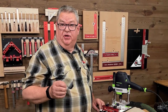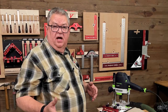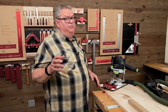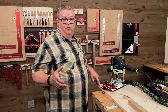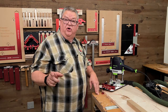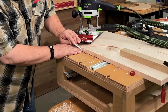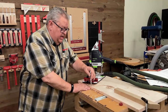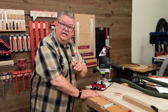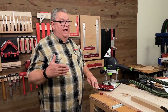When we did the first deep dive on the multifunction router base, I was cutting arcs all the way through the material. That gives a really nice clean edge but causes some problems — for one thing, I cut into my tabletop. On my brand new miter saw station I don't want to do that. So here's a better trick: I'm going to cut this almost all the way through, leaving about a quarter of an inch. We'll take that to the band saw to cut the last quarter inch of waste, then go to the router table with a flush trim bit to clean up the bandsaw edge. It'll be a perfect fit, everything stays together on the cutting table, it's safer, cleaner, and you don't cut into your table.